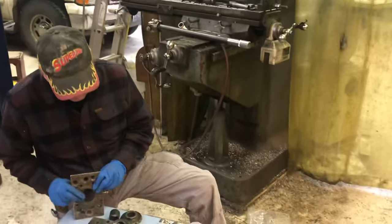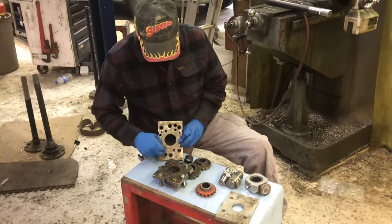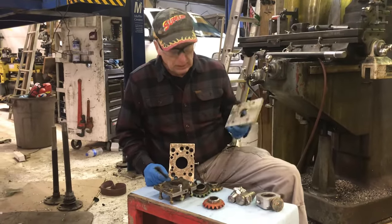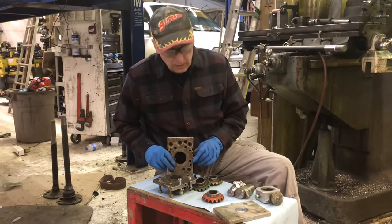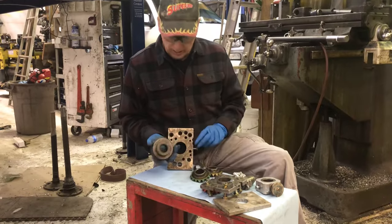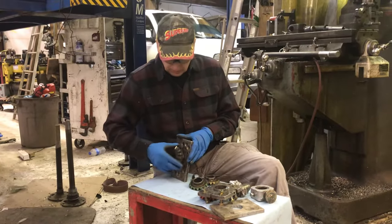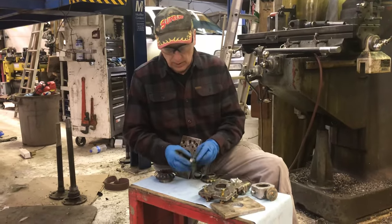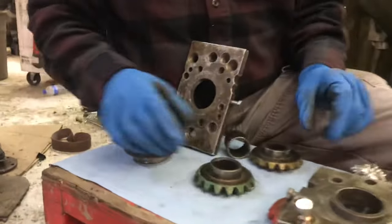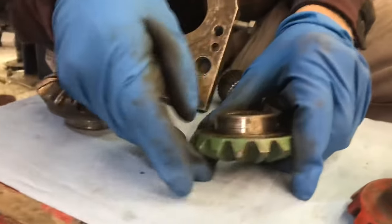This would go on a rear axle. Originally I wanted to put it on the studs, so they're countersunk, and I've got several patterns in these things. What I find is that the Dana 60 side gear versus the press fit — I have to press it in there, it's tight. And I've got flat spots ground on the gears so they can't rotate once it's in there.